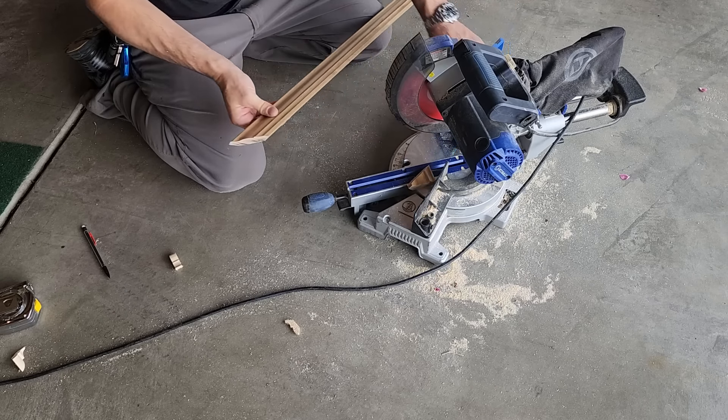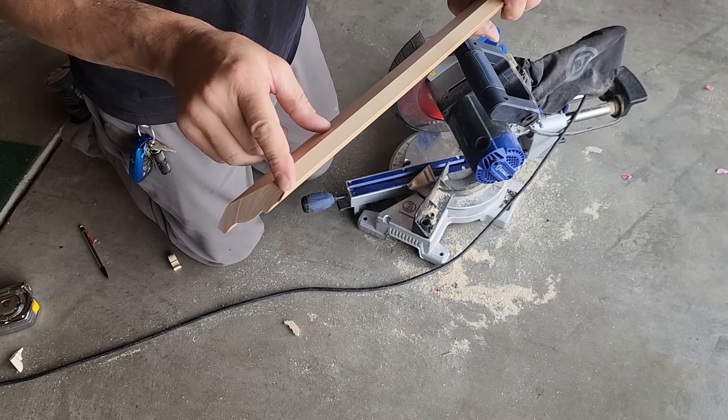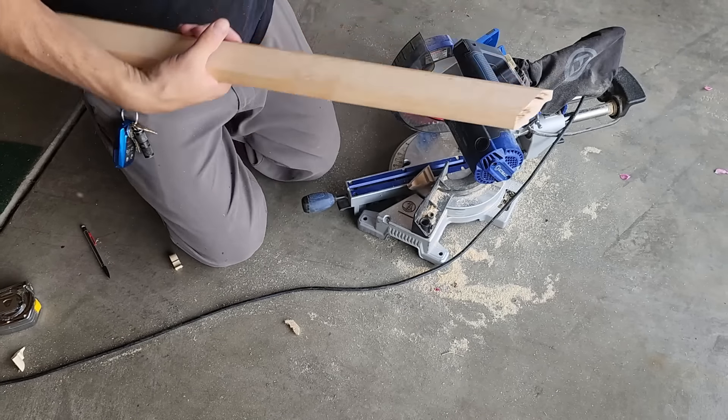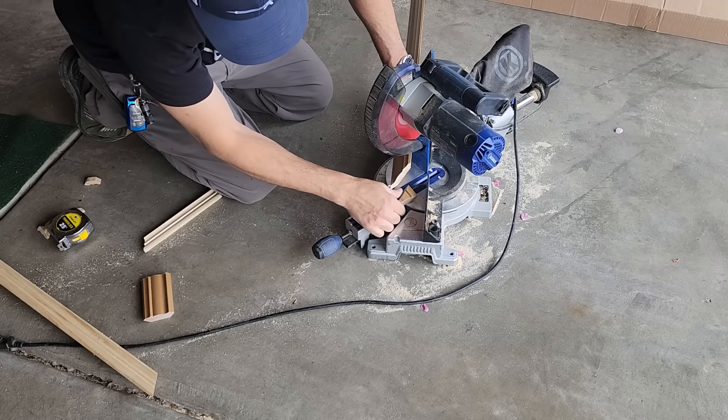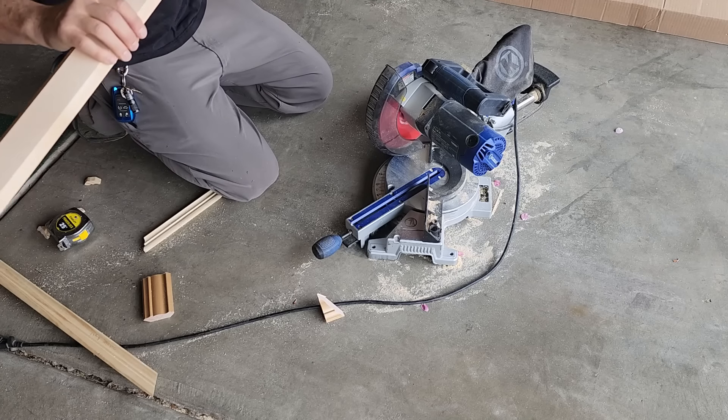Now I've got my other return. I'm going to cut this to length — from here over 12 inches. Now you have to replicate that. Perfect 90 — here's my protractor. Wood glue, this Fast Cap wood glue thick formula, and this is the activator. It's not that strong; you can snap this apart if you mess it up.